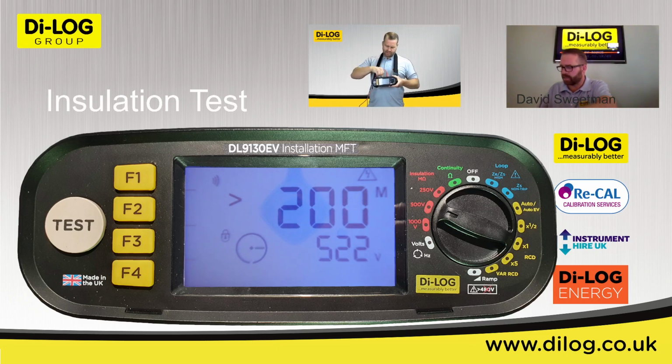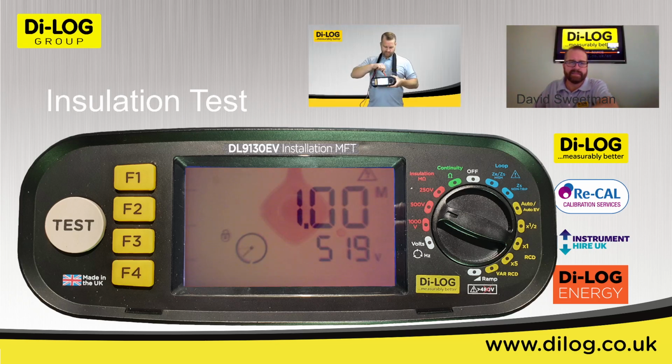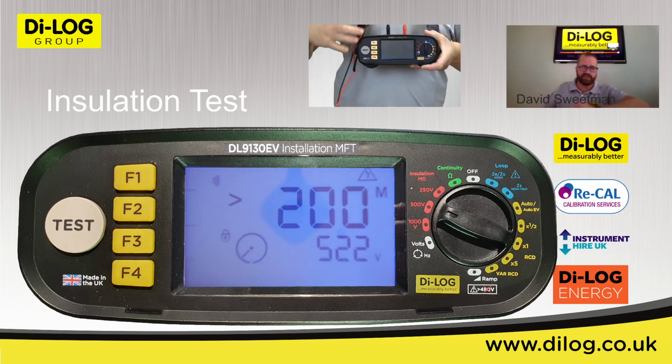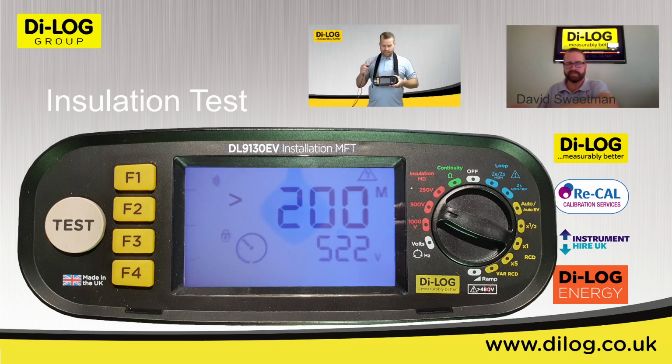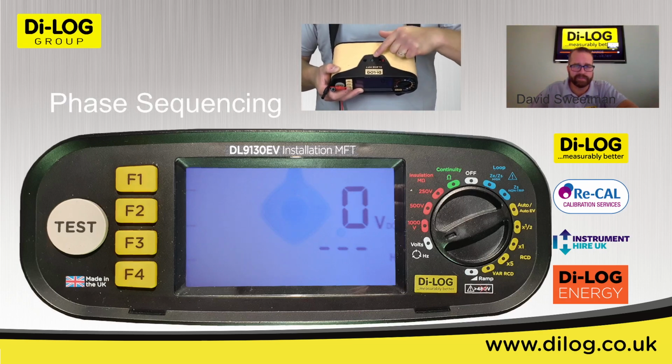But what it has also got as a safety function, if the results drop below 1 meg, the test will also indicate by the screen going red and set you into alarm mode. So voltage testing on there, it's fully auto ranging, AC/DC up to 480 volts, may I add as well. So you've got quite a lot of safety protection for any voltages that are above the standard 400 volt 3-phase you'd expect between phases as well. So you are fully protected on this as well.